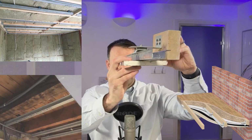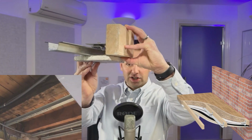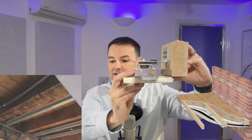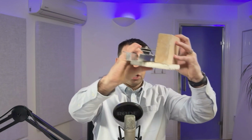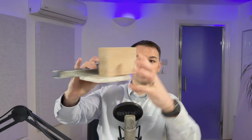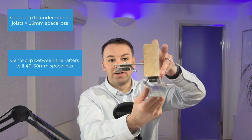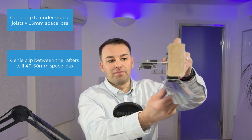By installing that 15 mil soundblock board, creating an isolation, you can go past the joist. There's about 5 mil gap there. I don't know if you guys can see that, but what it's done is it's bypassed the joist. You've installed this to the channel, and it's not touching the joist. And that is a way, instead of having the clip and channel to the underside of the rafter. So hopefully you can see that, yeah? So you can see the difference there compared to there.